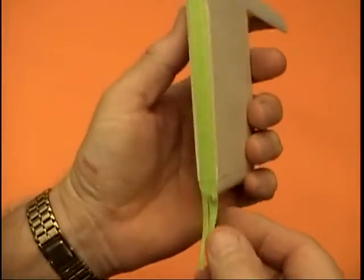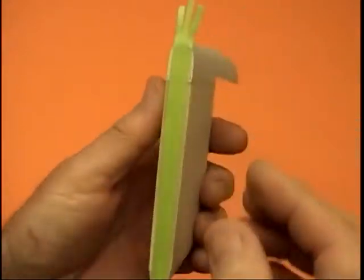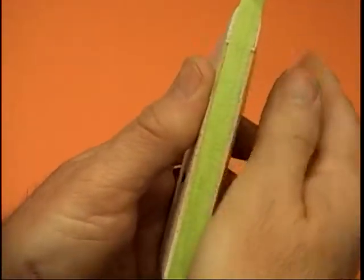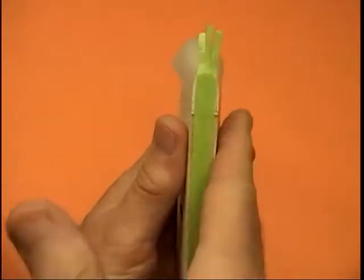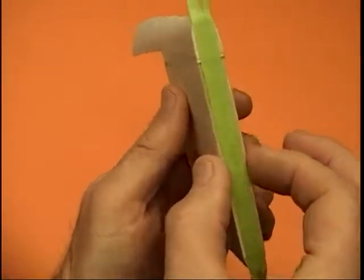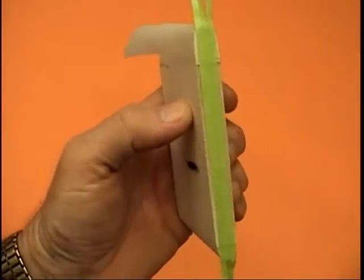So what I did, I laid out 3 pieces of 1/8" tape. And you can see how much I'm going to have to sand. I'm going to sand this into that shape so that the edge of the tape, in fact I'll put a little ink line on there, but what will happen is as you wind up hitting the tape, you can feel it, and that'll give me a 3/8 piece, and I'll know my rudder post on the rudder will have to be 3/8.